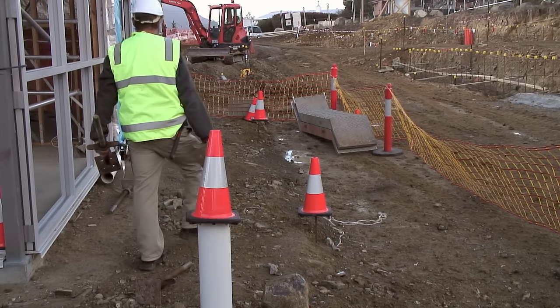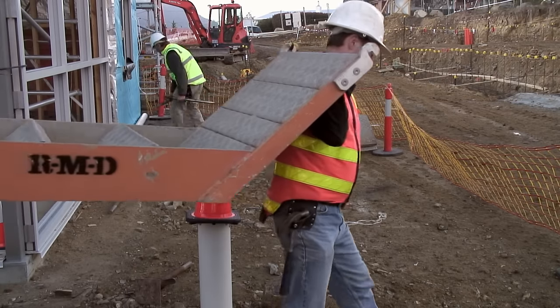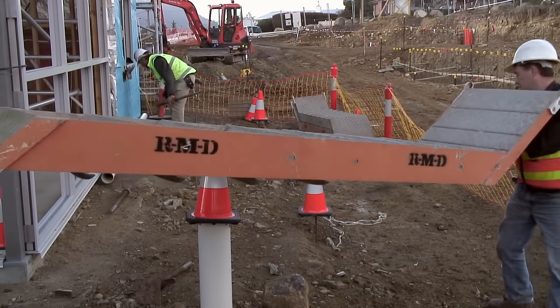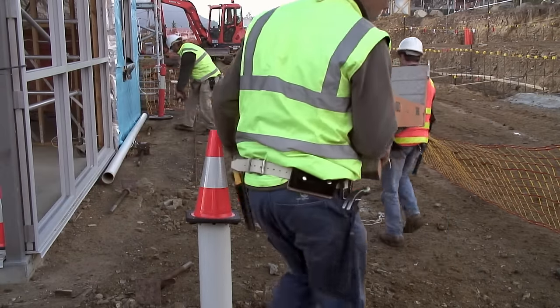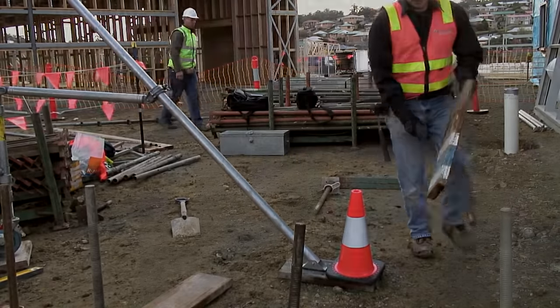The parts for the first lift are laid out to roughly set up the positions of the sole plates. It's easier to place ledges and transoms between two sole plates than to measure.